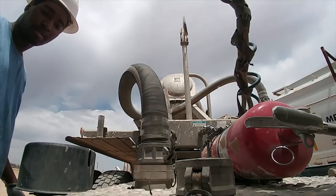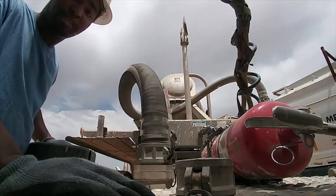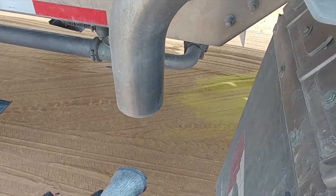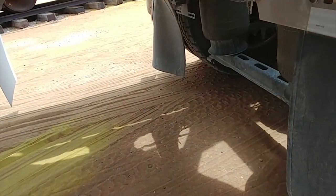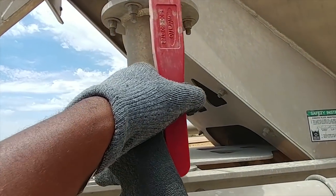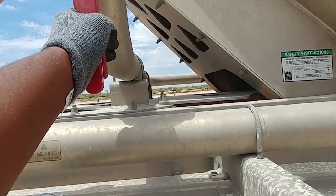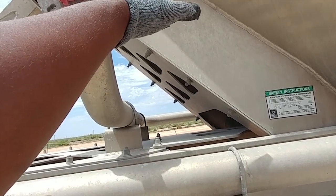Now we start to blow up and start unloading. You got three levels. You got your emergency valve, which pretty much lets air escape out of here if your pressure gets too high. On my trailer it's red — if the pressure goes too high, you open the valve and air escapes out, which brings the pressure down. So before we start, we want to close it off because we don't want air escaping. Always the first step is to close the emergency valve.